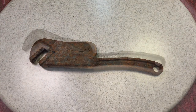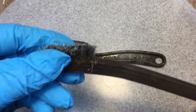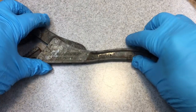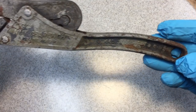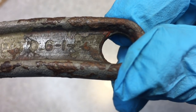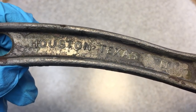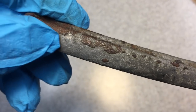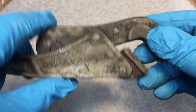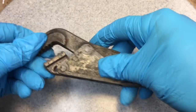We'll put it in vinegar now. Here we are after 24 hours in a vinegar soak. Every eight hours I take the wrench out and scrub it with one of these — you can see how much I wore this down — but you have to scrub and scrub and scrub, then put it back in the vinegar. After 24 hours most of the rust is gone. Some interesting things: you can see it says forged steel, June 1st 1926 was the patent date, and over here it was from Houston, Texas — another Texas wrench. It looks like it might have been galvanized or had some kind of coating, so be real careful, you don't want to breathe that dust in. Always wear a mask.